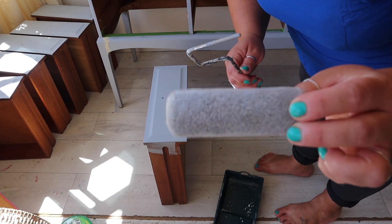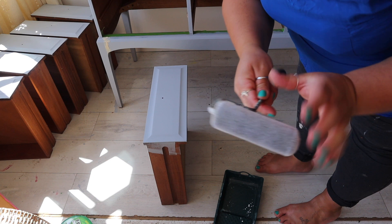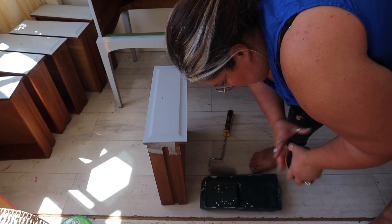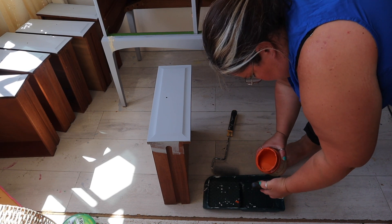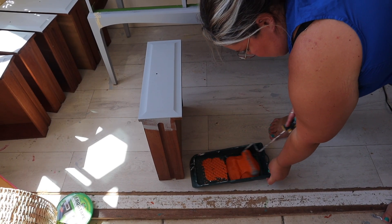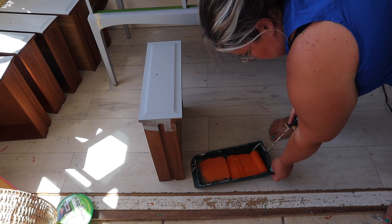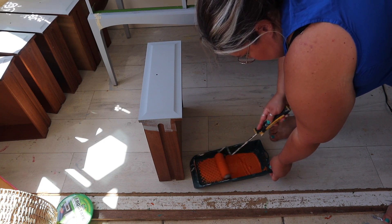I have applied two coats of Boss — in between each coat I've sanded, and I've also sanded the second coat and wiped it back. I'm going to use a roller to apply my chalk mineral paint. I'm using the color Florida Orange — as I mentioned it's a really punchy vibrant orange. I'm giving it a good shake to make sure all of the ingredients are mixed thoroughly and then I'm going to decant some into my roller tray. I always use a roller tray when applying paint — this way you get exactly the right amount of paint on your roller, which contributes to good coverage.